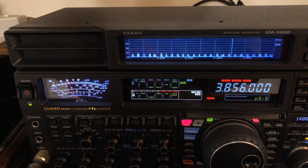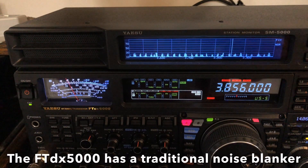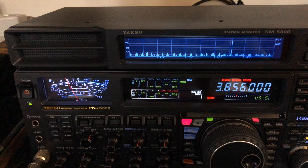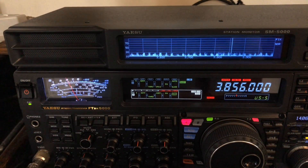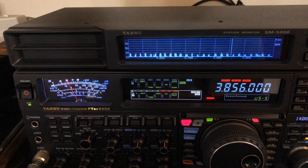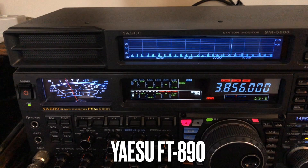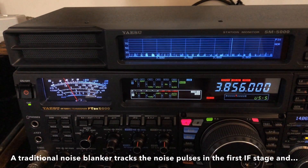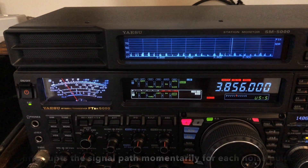I've mentioned this in passing before, but a traditional noise blanker was better, especially at dealing with power line noise or ignition noise from your car. Traditional noise blankers did a really good job with that. The FT-890 — I'm always singing its praises because that radio has the best noise blanker I've ever used. It's just a traditional analog noise blanker, and it can knock all my ignition noise out in my truck without degrading the quality of the receive audio at all.